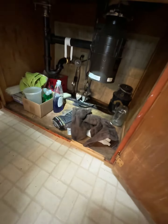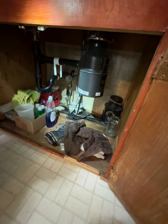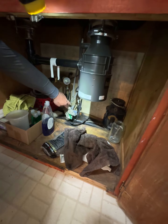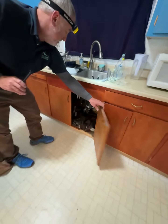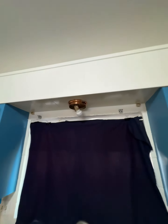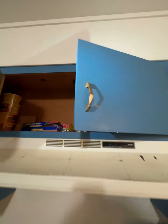Pretty heavy mold — heavy corrosion at the stop valve right there. Some exposed wires too, right there and just back there as well. This should be either in conduit or behind the wall.